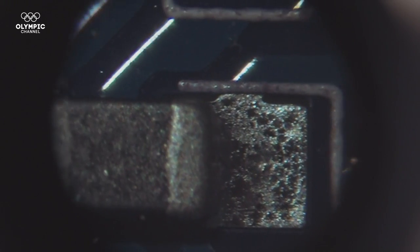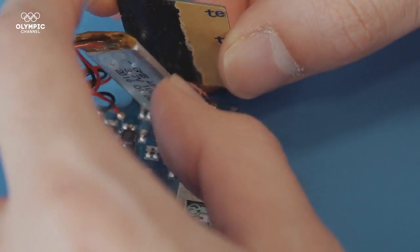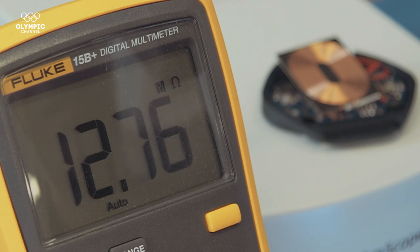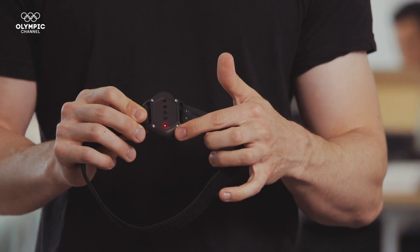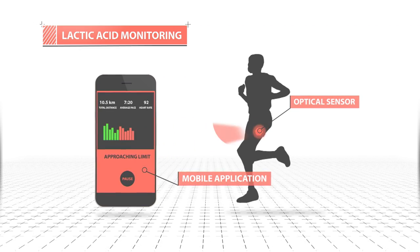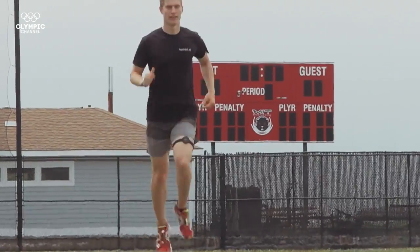This is the HUMAN Alpha prototype — a sensor that measures the oxygen level in an athlete's muscles. It uses an optical sensor which shines different colors of light into the muscle, and then several sensors read how much of that light is recorded, and based on the properties of that light and how it changes, we can tell how much oxygen is in the muscle. By taking advantage of spectrometry, a LED light shines through the skin. An optical sensor then examines the light that bounces back. A small change in color is provoked when there is an increase in lactic acid, which is measurable by the device and can warn the user to pause training.